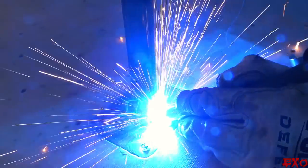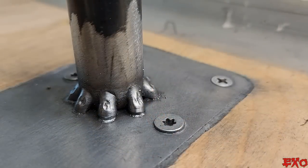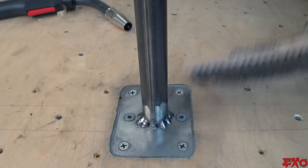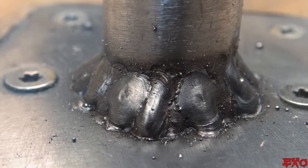It was important to evenly space all the welds. After giving plenty of cooling time for each burst, all eight spots at the base got filled in with another eight all around. With a good three seconds each, that's over 45 seconds of welding time per one-inch pipe. Even with constant beads, I don't think there'd be that much. Not too shabby.